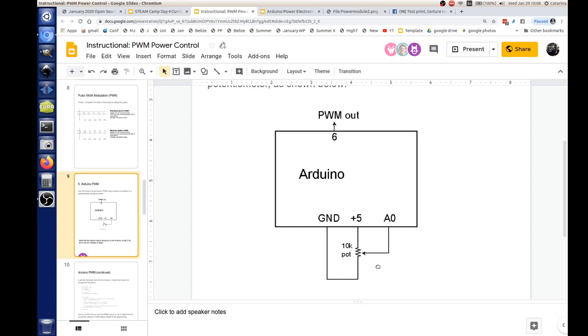But first he changed the driver and it didn't work. It's only after he changed the RAMPS board that it started working again. So something got fried again. But then there was an extruder problem, and that couldn't be fixed by changing the RAMPS board. So then he changed the Arduino board, something was wrong with it also. So he changed it again, and now it's functioning. I hope. So what caused it? That's still a mystery to us.